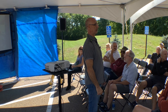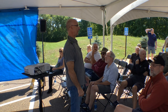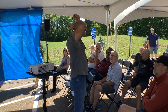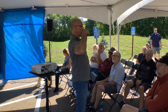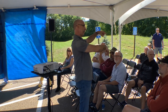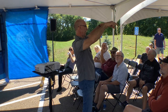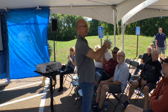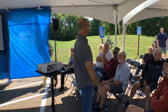Left-hand spin. They use the shapers. I got one set up right-hand, one set up left-hand. So my friend who owned a cabinet shop and made residential cabinets for years, they had, I think, five shapers. One always had a cope cutter, the other always had a long grain cutter, another one always had the panel raiser, and then the reverse cutters, the same cutters in the other ones, but able to run in the other direction. So they just go, why change bits if you can just change shapers? It's kind of the Norm Abram approach.